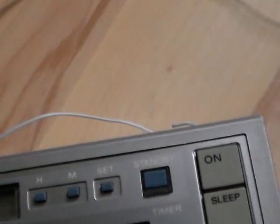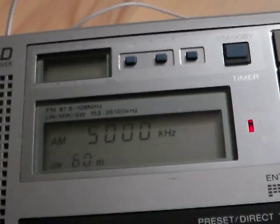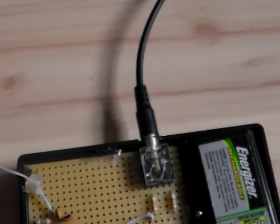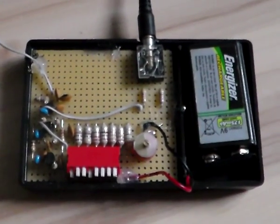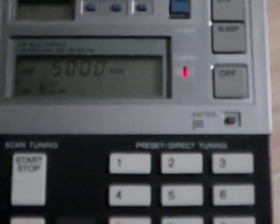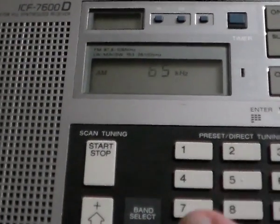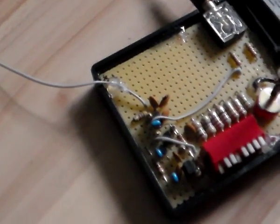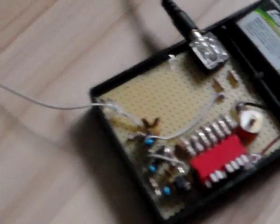It's not making 100% AM, but it's definitely loud enough. On five megahertz it's also kind of stable. That's my small transmitter from medium wave to short wave. We can do one more frequency — let's make 6.5 megahertz, which is also an audio subcarrier frequency of some TV systems. I don't know exactly which ones, but I know it's an audio carrier frequency.